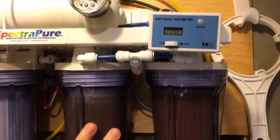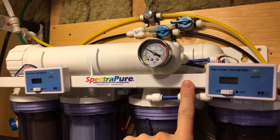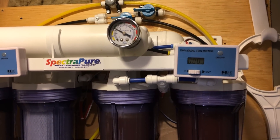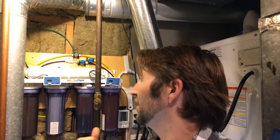So I like having two meters so I can see my source water, water after the membrane, before DI, and after DI — because I have two stages. You probably don't need two, but I'd recommend getting at least one so you can see your source water and your output water. It's going to help you know when to replace your resin, when your filters are going bad — they're a great little add-on. I'll drop a link below if you guys want to pick one up.